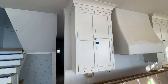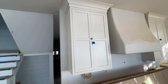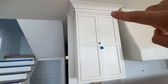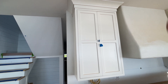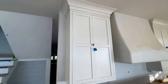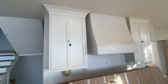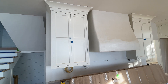We like to set our cabinets roughly six inches from the ceiling. The cove molding is typically about three to four inches tall, so once you apply the flat stock it gives you room to set your cove molding nice and tight to the ceiling. Once that's done, we caulk all of it for a really clean look. It's a simple detail, but that's how we apply our crown and cove molding to get that layered look butted tight to the ceiling.